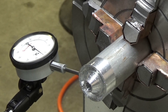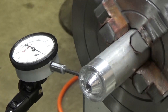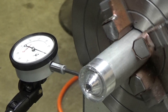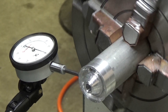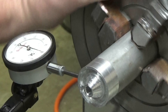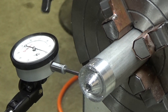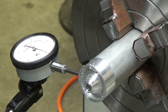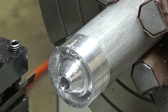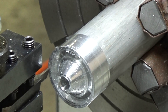Whenever you have a mishap like that, it'll tend to knock your stock out of round. You should be able to just adjust it back in the four-jaw chuck — showing 9 thousandths of runout. Alright, let's see what we can do now. And reset the DRO.